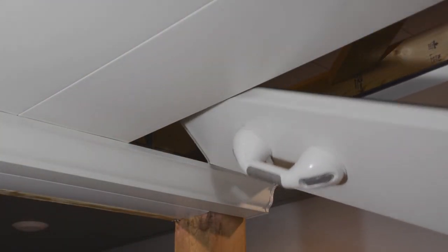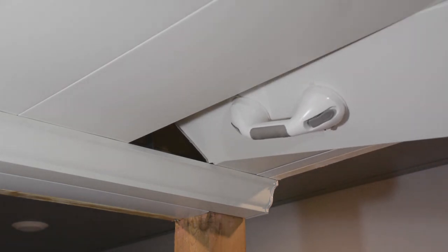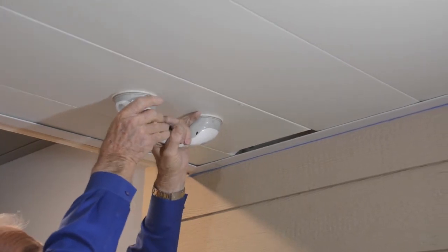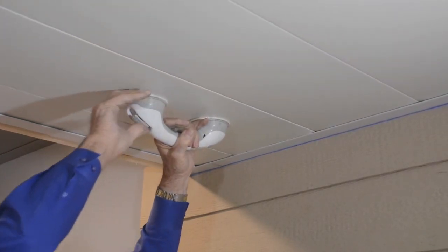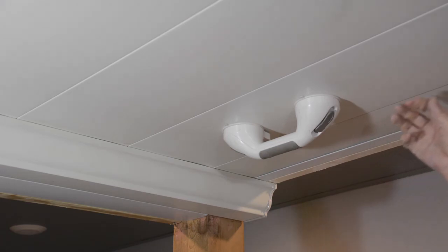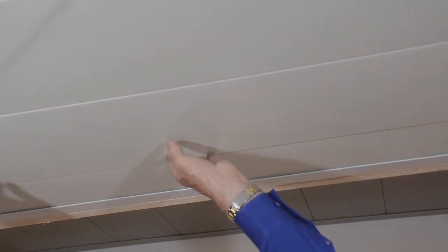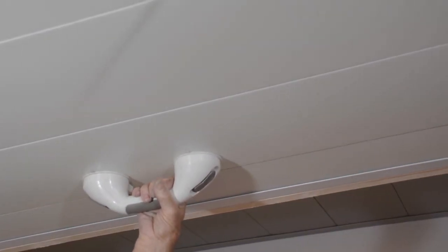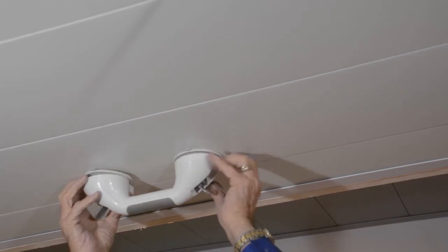Place the panel on the gutter with the flat side down. As the panel is fitted into the wall channel, the overlapping bend will fit into place. When it fits, pull down on the suction cup and back to engage the panel. Engage the panel latch by pushing up on the seam between the last two panels. You will hear a click as the panel latch engages. Tug down on the panel near the location of the panel latch to make sure the latch is engaged.